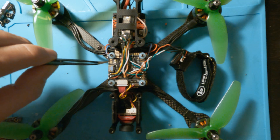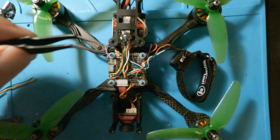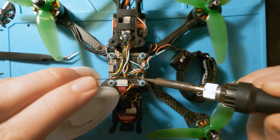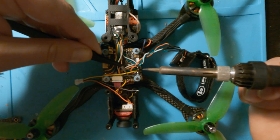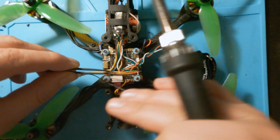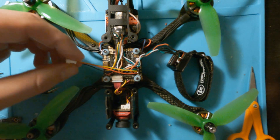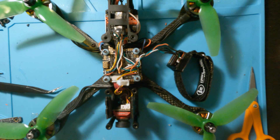You could use the TX, RX, LED, or PPM pads to trigger the LED on and off — so basically the yellow wire. The ones I'm going to use are right here. I'm going to put some solder on those and then we'll just get the connector on it. Right next to it we have the five volt pad — for this specific flashlight, five volts is all you need. Now we've got the ground on there. This is the connector that's going to go onto the flashlight, so once that's drying we'll be able to plug it in and see if it works.